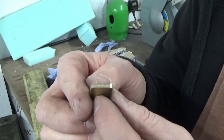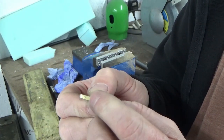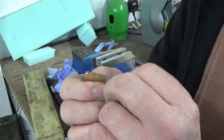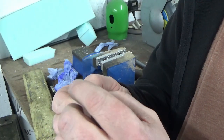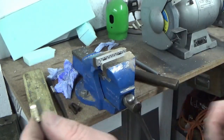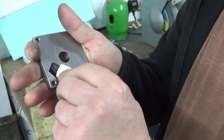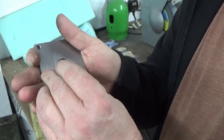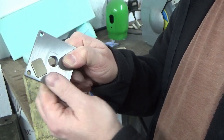So there we go. What we've done there is we've upset the surfaces with the centre pops. Every time you centre pop something, the material doesn't disappear. You don't squash it down into the material. What it does is actually squash it back out past the punch and leave a raised edge, and it's often a lot easier to control a light press fit by using that method than it is to try and control it by all the sizes.